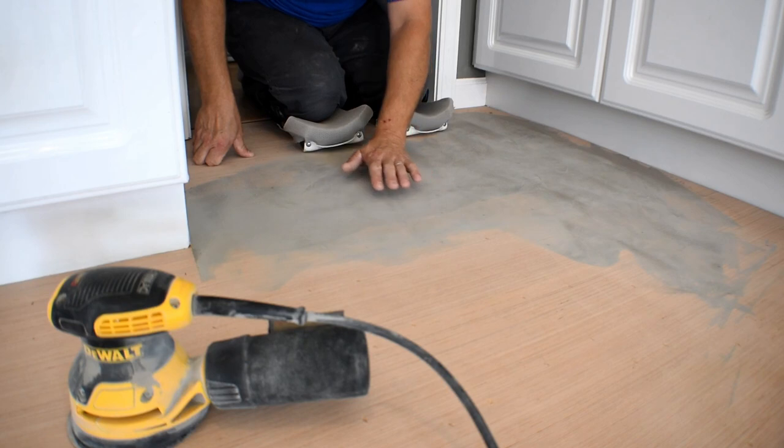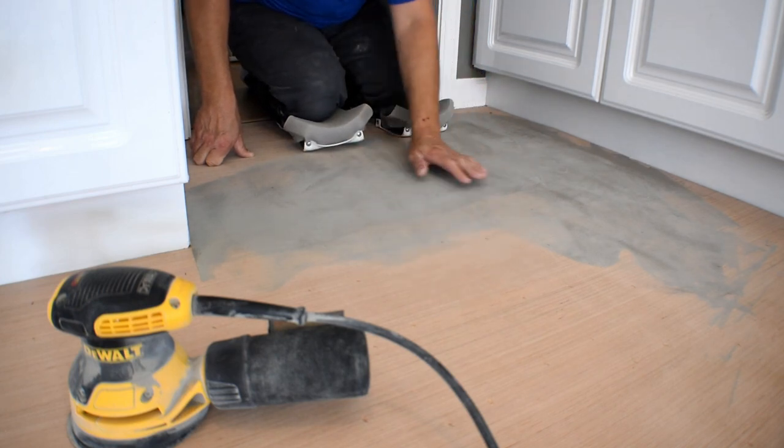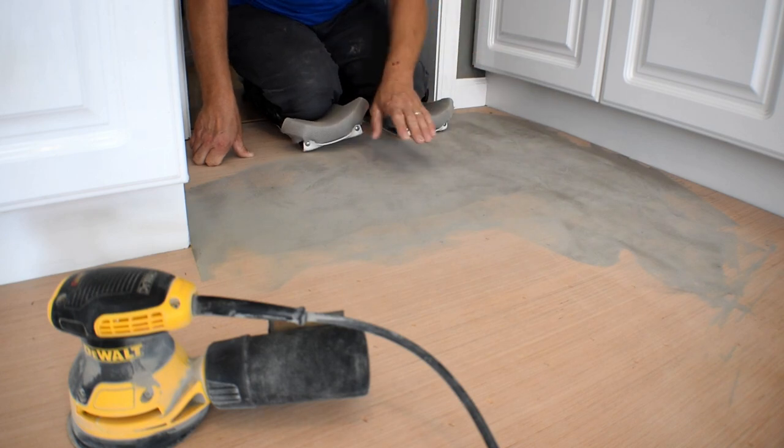As you see, I kept it moving really fast and now this right here is even slicker than the original underlayment itself — this is really smooth. I just don't know any better way to get this floor patch that smooth than doing that. I hope you could get something out of this and maybe it'll help you on your jobs. If you did, hit the thumbs up down there and be sure to comment. This is worst case scenario — if you do this right here to your floors, it doesn't matter any situation: how the light is, how shiny your floor is, you're going to be covered because there's no way anything is going to show up and look faulty if you do these steps on any glue-down product. This is going to cover every base to ensure a nice smooth slick floor. Thanks again — until next time, FBS out.